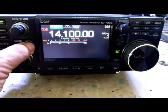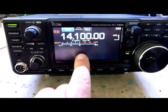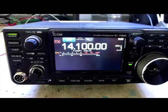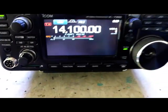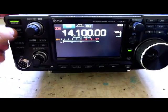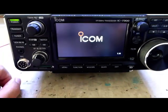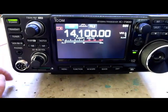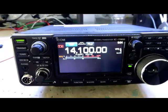Have a look at the diagram — the display only has two integrated circuits associated with it. One is for brightness and back illumination, and the other decodes the matrix of the X and Y for when you're pressing buttons. But as none of the other buttons work — the only button that seems to work is the on/off — we're going to have to take the lid off, have a quick look inside, and find out how we can tell if the processor is being held up.